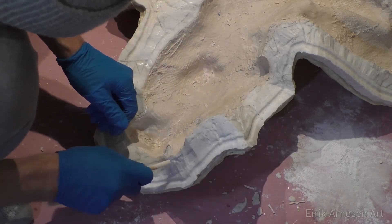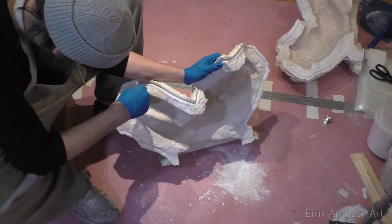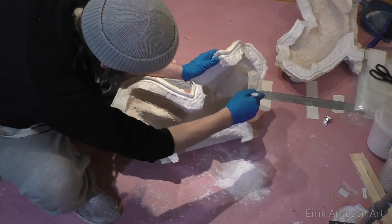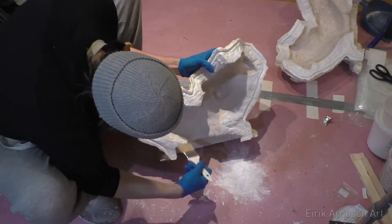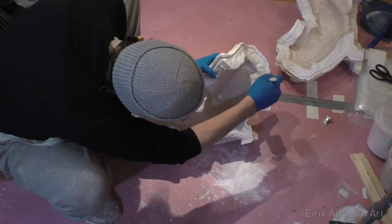When I'm done I brush out the debris from the inside of the mold. When I flip the mold over to close it, this debris can land along the seam and impede a proper fit and make the seating not quite right. When I close the mold I put one hand on the inside of the cast to hold it in place while I flip it over so the silicone or the cast doesn't fall out.